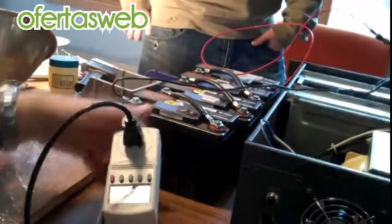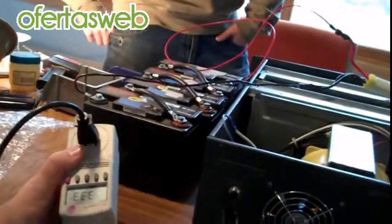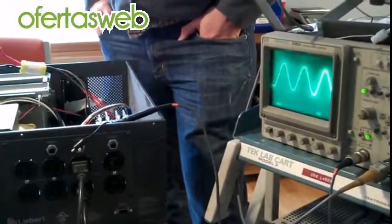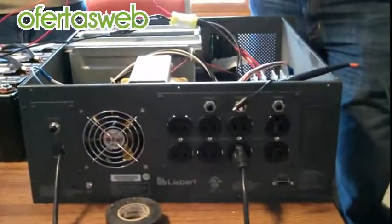The light bulb was 100 watts. When it was off we were seeing 40 watts — I'm not sure it was charging. When it was on, we were seeing about 200 watts, so I'm guessing that was powering the circuitry and charging the battery. So I'm guessing 100 to 150 watts to charge the batteries. We were using a 100-watt light bulb over there just as kind of a test load on the UPS.